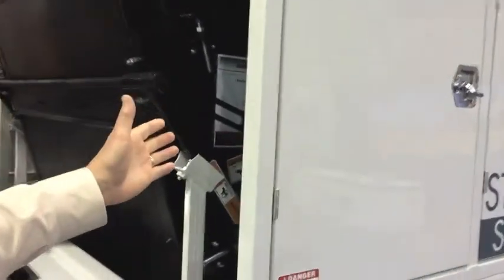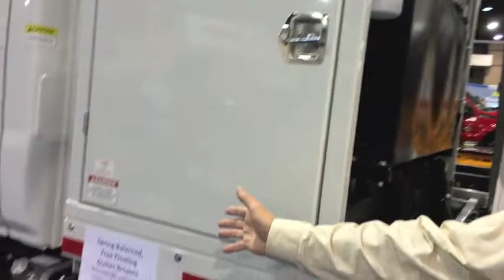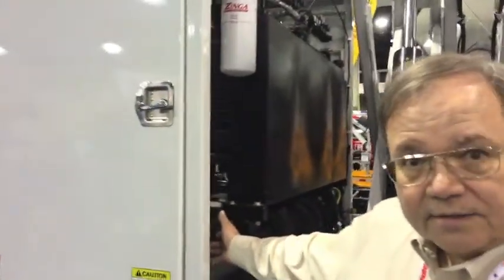The unit also comes with 330 gallons of water, equally distributed between a standard 200-gallon tank in the rear, which I'll show you in a few minutes, and a supplemental 130-gallon water tank supplied in the front. The weight is distributed equally across the frame of the chassis. So what you've got here is, in a non-CDL chassis, 26,000 GVW, a full-featured, essentially mid-size sweeper that contractors do not need a CDL